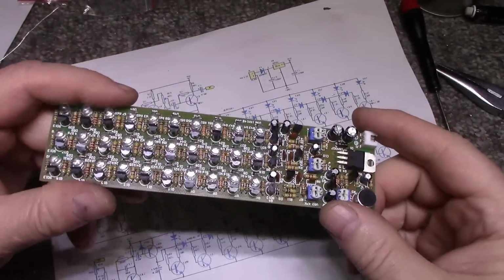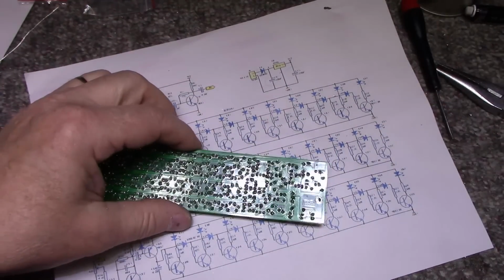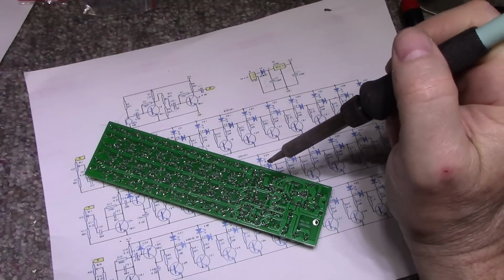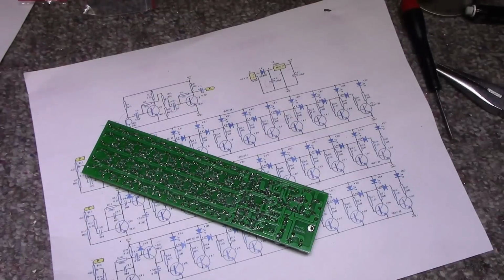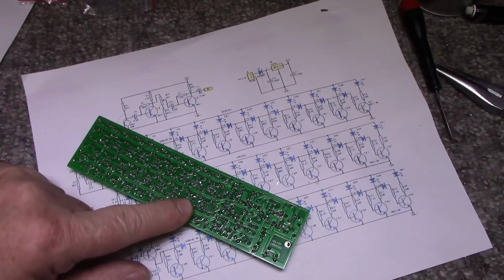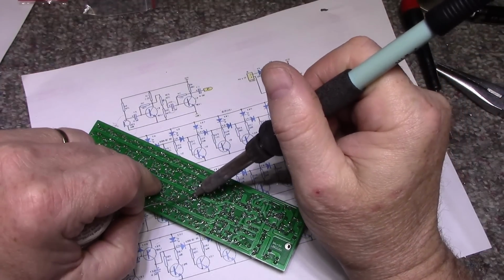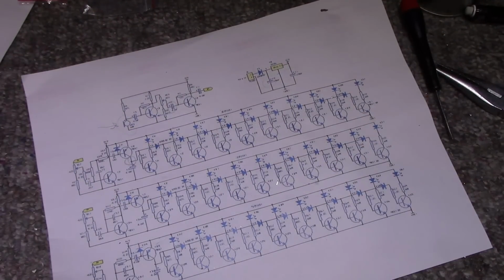Okay, just finished with the LEDs. They're all in, and I just held it up to the light, and I was looking through the board, and there's probably about 5 joints that I need to repair because they don't have adequate solder. Not enough to flow around the lead and the pad. So this one here, and then there's a few other ones. Next one's right here. I did run the soldering iron over them, it just didn't get enough solder on these pads. It's too little. So I'm just going to fix up my goof ups right now.